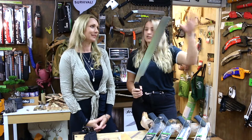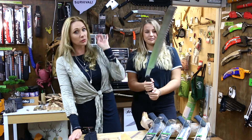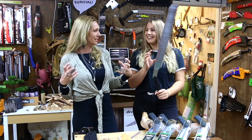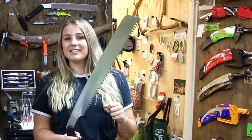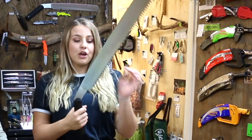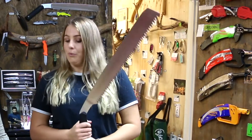What you are looking at now are the big giant teeth at the top. You're also wondering why the teeth are so small at the end. This is like a family that has one sister who's the tall skinny one and another who's the short dumpy one — this is kind of like the short dumpy one and the Katana is the tall skinny one. They're both half a metre long but this one is just chunky. The reason for the graduating teeth is that Japanese saws, and especially Silky, only cut on the pull stroke. The idea of having graduating teeth is that if you start the cut at the handle and draw the saw towards you, you have little teeth starting that cut, which makes it a lot easier and smoother to use. But once you start getting through that cut, the larger teeth kick in and it's just one hell of a saw.